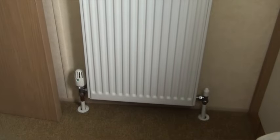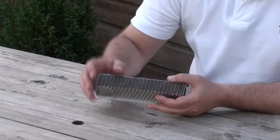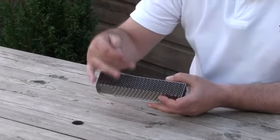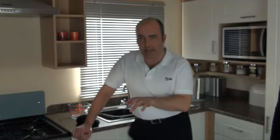You'll do this for all of the hot outlets, which in this property means one kitchen sink, two wash hand basins and a shower — so this means that your boiler is drained no less than four times. I'm referring to the fresh hot water; the central heating loop of water in the radiators will have antifreeze in it and doesn't need to be drained. First, it means that your boiler is drained for winter without you having to touch it, and second, you're already halfway to cleansing the boiler which will save you roughly 15% on your gas bill. I'll cover this process in a later chapter in the DVD.